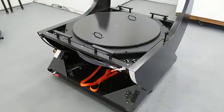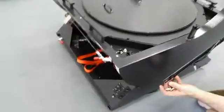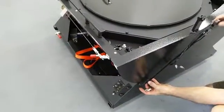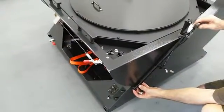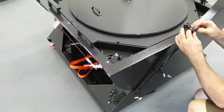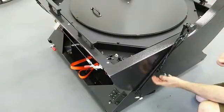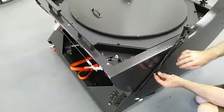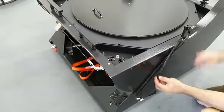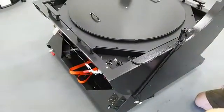The next step is to install the altitude encoder and arm. You'll see the bottom has a slotted end — this slots over the bolt in the rocker. Do not tighten this; it is meant to slide. Put it on the bolt and tighten up the set screw. When you put this on, make sure your wires are over the face so they don't get trapped underneath it.